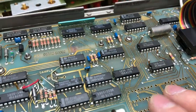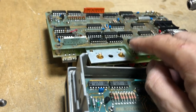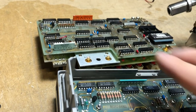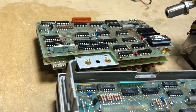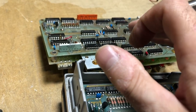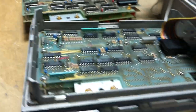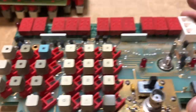I'm swapping the A2 boards because I tested the donor board last night in the donor counter — even though the donor's low-frequency channel isn't working, the high-frequency channel does work and I was able to get correct DAC output values from it.